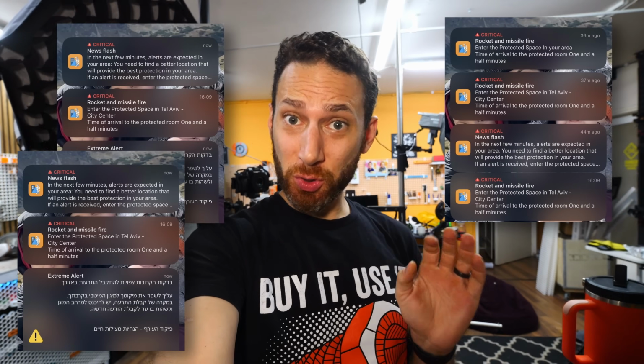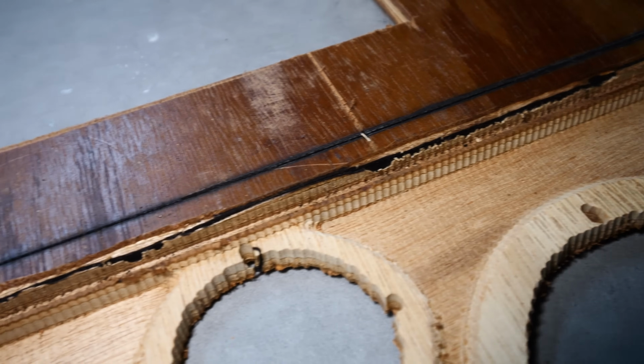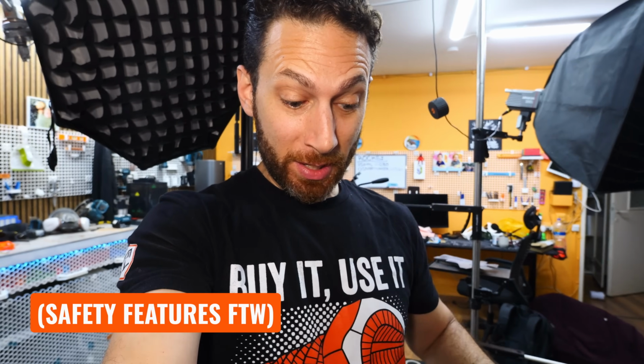Hey, we are back for another day. Had to head home because things got a little squirrely yesterday. So I'm having this problem where I'm able to line the laser up perfectly and get the cuts. But what's happening is because I need to cut lower than where I actually am, I need to focus the laser lower, and it's causing visible fires, which is shutting the laser down.